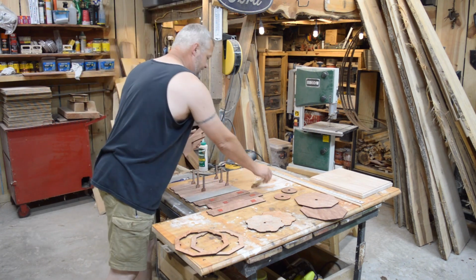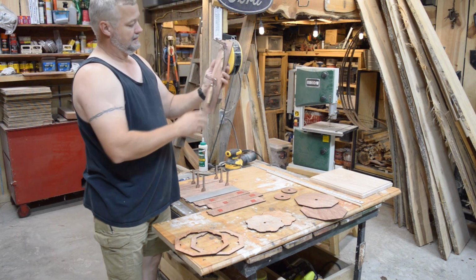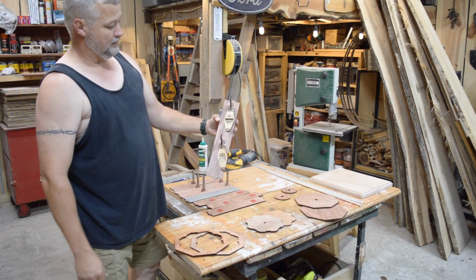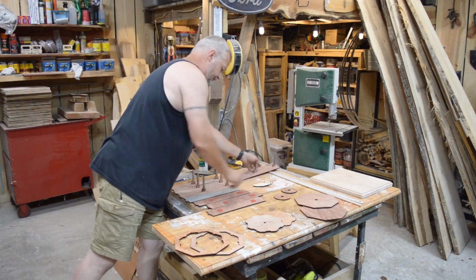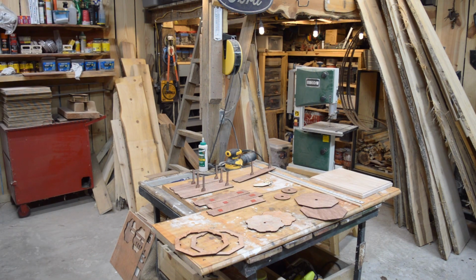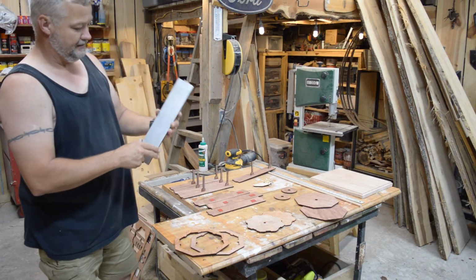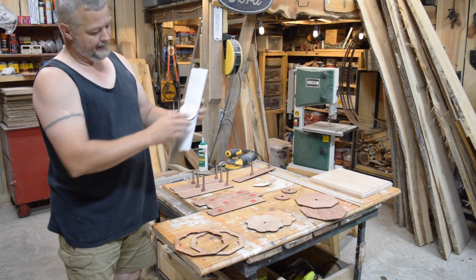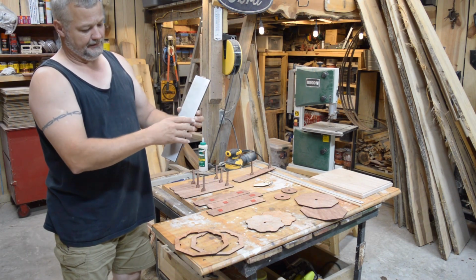But just to give you an idea, this thing holds 8 panels, and each panel is going to have a different job. That's the way that these will kind of hang on there, like so. I've got 4 panels that'll be holding keychains, and I've got 4 panels that'll be holding the fridge magnets. And what I did, let me find a magnet here. What I did is I've taken the panels, and I got over on the bandsaw there, and I cut me some small thin pieces of metal to fit these panels, and that way the magnet will be able to secure the piece to the metal plates.